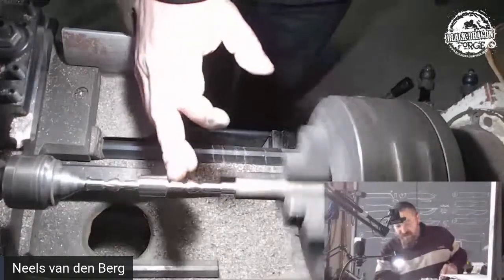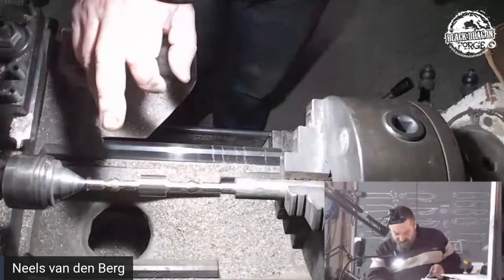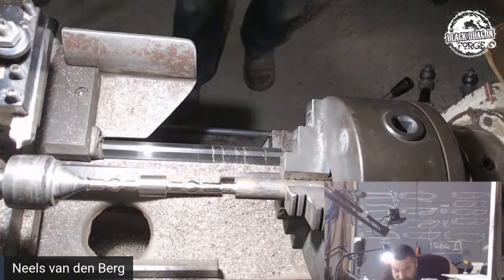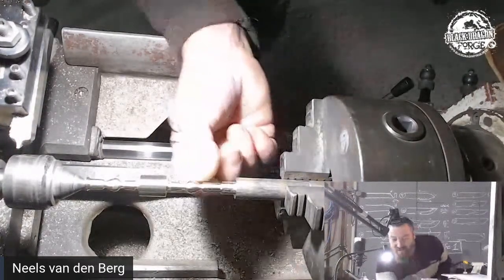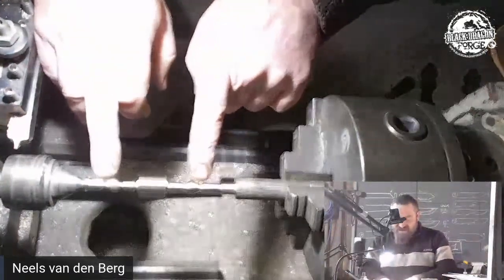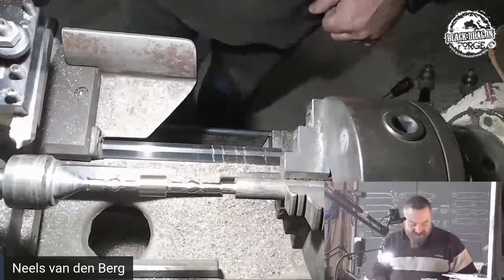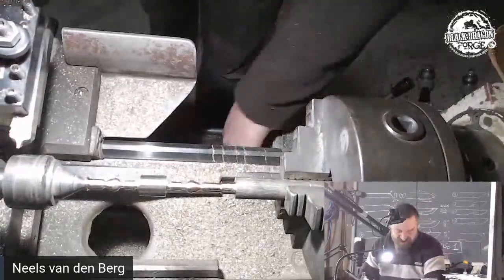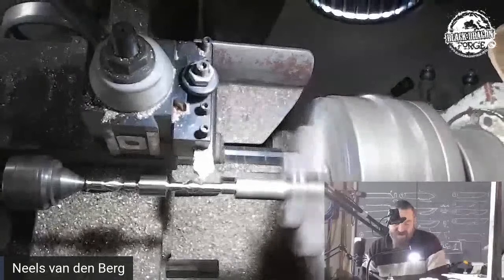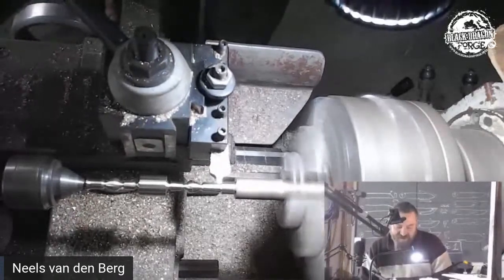Right, so our little grooves are now cut to the same depth, two inners and the two outers. The acorns are roundabout in the light that I have. It looks fairly cool. All right. The little finials at the ends, those little balls at the end, we're actually going to leave those. We're going to file those in by hand, because as soon as I start cutting in here now, it's going to add pressure and it will break on those, yeah? And filing those in by hand is going to be really quick. But I do want to clean up a section for me if I need to relay that, re-chuck it up. I actually have a section that I can do that in.